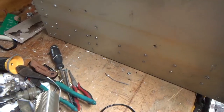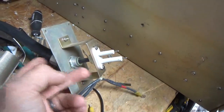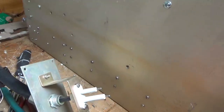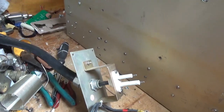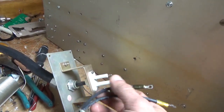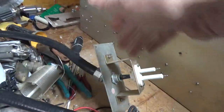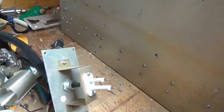So I'm going to show you — this is called an Alden connector. This plugs into the bottom half right here. There's an interlock, so if this is unplugged and pulled out, it'll shut down. I'll go over all that in another video. This is secured through the hole in the back — I'll show you when I flip it around. The B positive and B negative come through this flexible metal conduit, so it's shielded, and you can't get a shock or electrocute or anything.